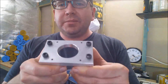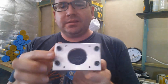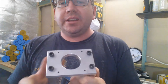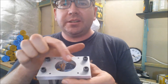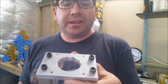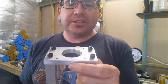That's the plates I've been milling — that's a NEMA 34 mount, goes on the end of the table. Like I said, the edge finish and everything I'm happy with. I bought a little chamfering tool so I've been able to deburr and chamfer the edges, which I'm happy about. It's just top finish and that sort of thing — I'd love to run a face mill straight over it and just shine that up a bit.